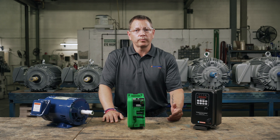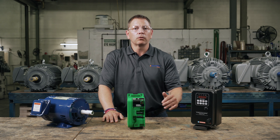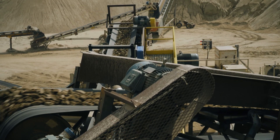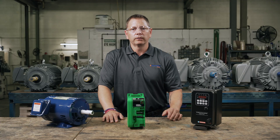For example, if you have a 10-horsepower motor, you're probably fine to get a 10-horsepower VFD. In this example, the 575-volt motor draws 10 amps. The VFD is probably rated for 12 or 13 amps, and even with minor overloading, you'll probably be fine. Where we have seen customers oversize the VFD are in more adverse, prone-to-overload conditions, like in an aggregate application where the motor could be prone to consistent overloading. Generally speaking, you can match the motor horsepower to the VFD horsepower and you'll be set.